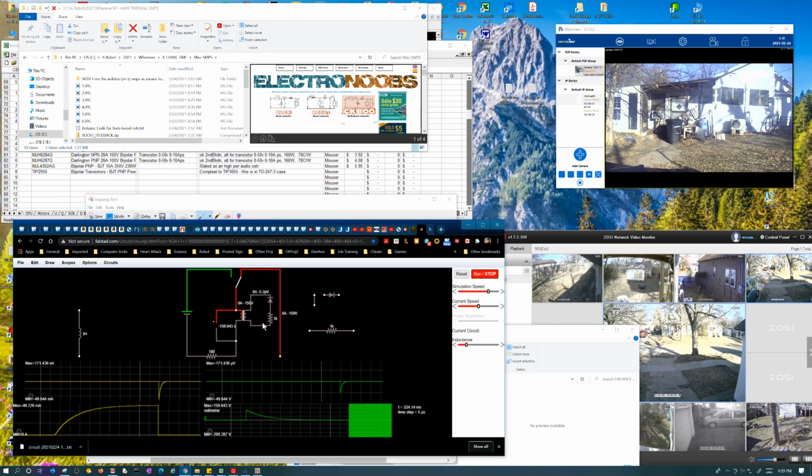So that's why I was postulating that if we charge this field up with 1 amp at 100 turns, it should, in theory, discharge at 10 amps because it's trying to maintain that field. It's not so much current as it's a field it's trying to maintain. The number of turns of wire is irrelevant, with the exception of what kind of current and voltage it's going to try to produce. And voltage doesn't even enter the equation at this point. It's a field at a static state, a static charge, with a static current through it. It has nothing to do with a rate of change.